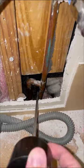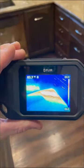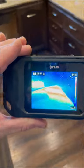I cut open the wall beneath the kitchen sink and located the manifold, then used this listening device to attempt to pinpoint which line was leaking. The water line on the right was supplying the hot water to the master bathroom, and I could hear water flowing through that pipe, letting me know that the leak was on that side of the system.